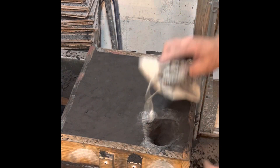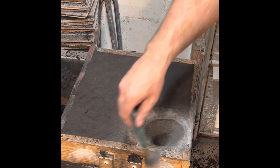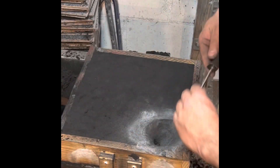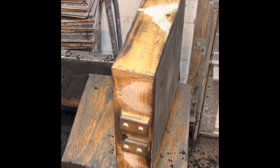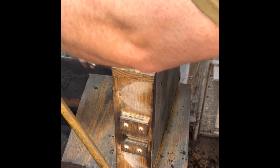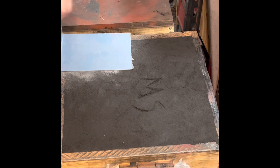Break out the parting bag — this is just a linen small parts bag filled with parting compound. That's an artist camel hair brush that breaks up the loose sand. I always mark mine so I know what they are and what order to lay them down, since I normally pour 10 or more at a time. Thinner castings get done first, thicker get done last. Sometimes they're different metals — sometimes I pour aluminum and brass the same day. Assemble the two pieces of the mold, then the dust cover — very important, I always use a dust cover.